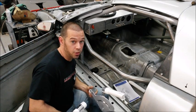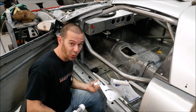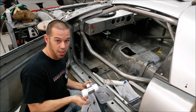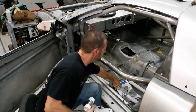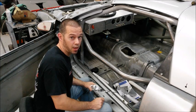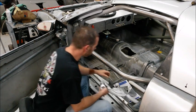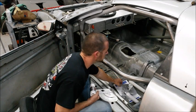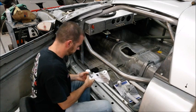I almost forgot to show you two cage gauges. I got all excited and did the math, and I was ready to go make a door bar. But let's use two first. So I got the second one set up for a 6.5 inch radius, and I should have everything here cut. Just assemble it and set it at the right angle, and we should have a door bar. So this one's still set for 36. This one needs to be set for 19.